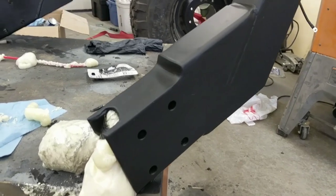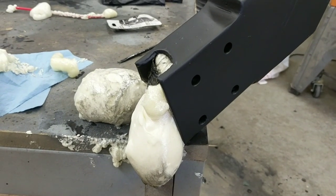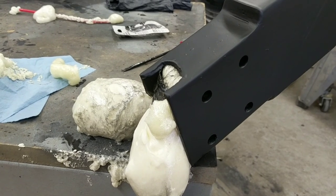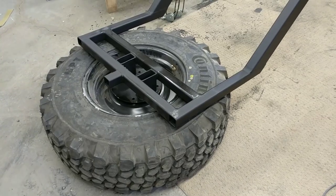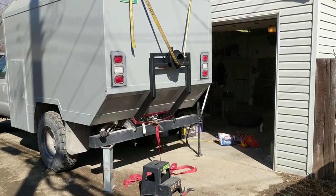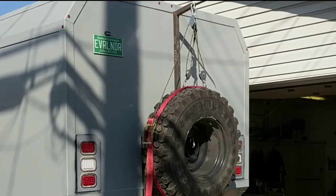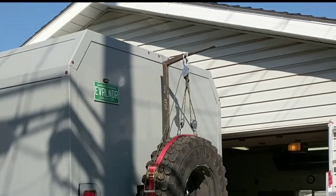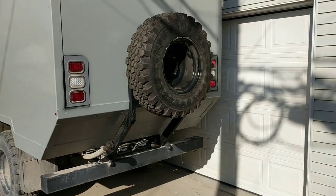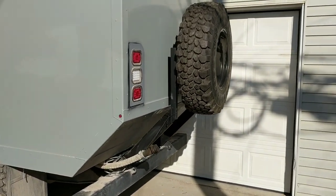These areas that mount in the frame could eventually get packed full of mud, so I filled them with expanding foam, then trimmed it nice and flush. I made sure it still fits in the wheel with the paint, hoisted it up, and wiggled it around until the bolt holes lined up and bolted it all in place. I tested out a four-to-one pulley system to see if it would work for mounting the spare — and it does, although I'll probably go to a six-to-one for real-world use.